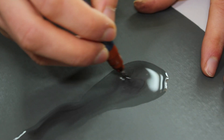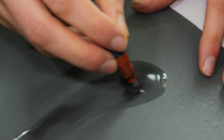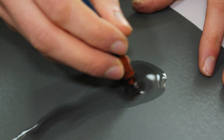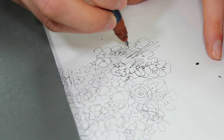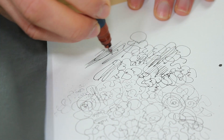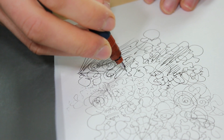Still catching a bit. I have a feeling that whatever they make these tips out of — probably some kind of stainless steel or maybe even tungsten — some of them even have a jewel tip. I don't think a jewel-tipped technical pen can be helped with this method, nor would you have a problem with a jewel tip, because they last practically forever as far as I know. That actually does feel a bit better — quite a big improvement. I'd been lightly sanding the tip for about five minutes or so, and it actually feels a lot better. That one worked.